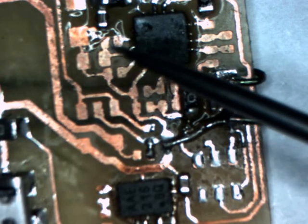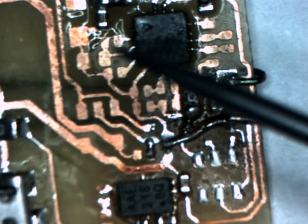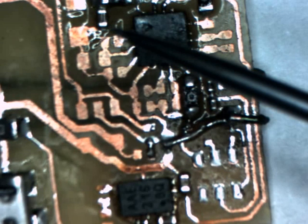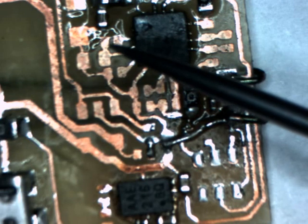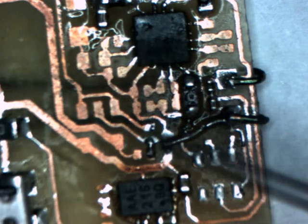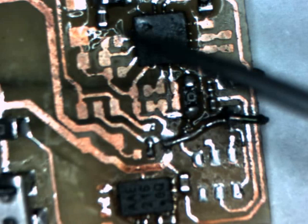Other setback I had was right here. There is a 4.42 megaohm resistor, and I did not order that for some reason. I don't have any 0402 resistors near that value. I'm going to try and finish this circuit with a 4.7 megaohm 0805 that I do have, so we'll see how that works. This is a solar charge circuit. I haven't had a chance to test that yet.